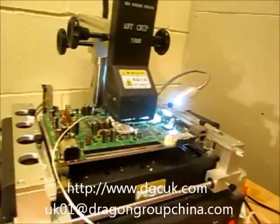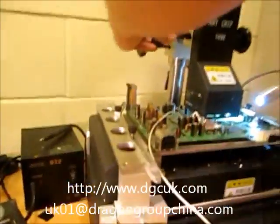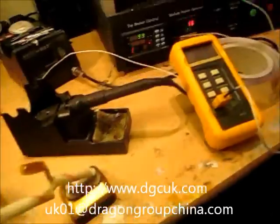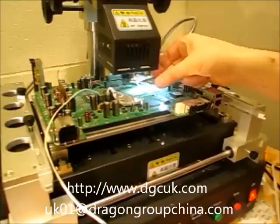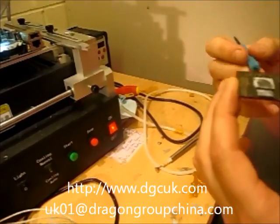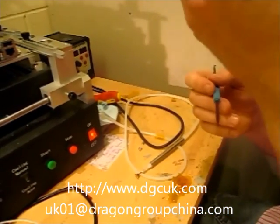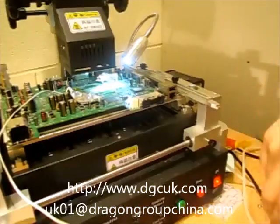The chip on this board is actually lead solder, so at 186 degrees I can actually lift the chip. You're reading the heat hitting the top of the chip, but by the time it's penetrated through the chip you might have to go a little hotter — the surface temperature of the chip might need to be greater so that the bottom temperature is hot enough to get a clean lift. Really what they need to do is get the profiles done correctly or reposition the top thermocouple so they can get a good chip lift.